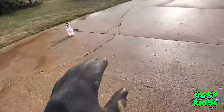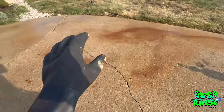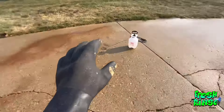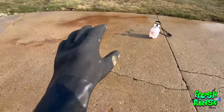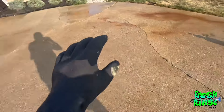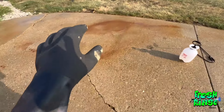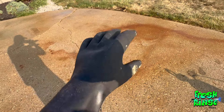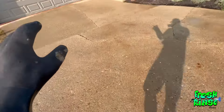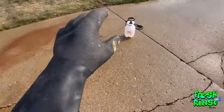There you have it. Now we have the concrete surface completely cleaned and rinsed. Now we're going to tackle all of this concrete area — in fact, I'll be covering the entire surface with this muriatic acid mixture. We're going to get all this rust off of the concrete. Now this is not rebar — this isn't permanent. This is topical rust, if you will. It's on the surface of the concrete, so this should come up easily enough.